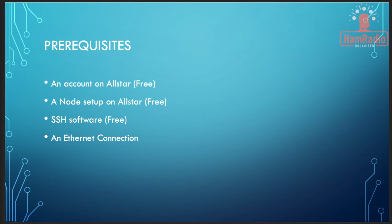The other thing you must have before configuring the SHARI device is also a node set up on AllStar. Again, this is free, and it's very simple to do, and there should be another card up on the top right that walks you through configuring a node. The links to both these videos are also in the video description down below in case you missed the cards up there. The third thing is you must have some SSH software, which is also free. And if you're on a Mac, a Linux, or on Windows 10 or higher, it's already built into the machine. You don't have to worry about doing anything. But if you're on an older version of Windows, you need to download a program called Putty. I'll put a link to that in the description as well.